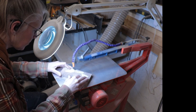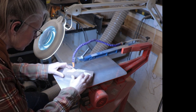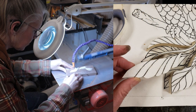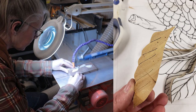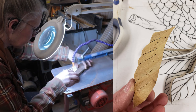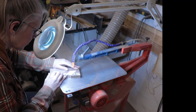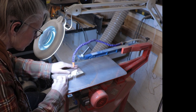Here's a trick I was privy to recently, and I'm able to do this on many areas of this project. See how this leaf has a bunch of segmented pieces? Instead of sawing each piece apart, you can saw the piece three-quarters or more of the way, like this. Then you can shape the entire piece, then saw them apart once they've been shaped. You'll still need to shape some after you've cut them apart, but not as much. And then there's no need for a sanding shim. Pretty cool stuff. Always finding out new ways to do stuff. I love it.